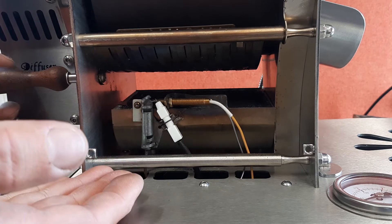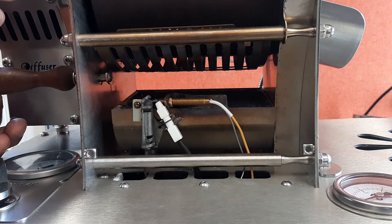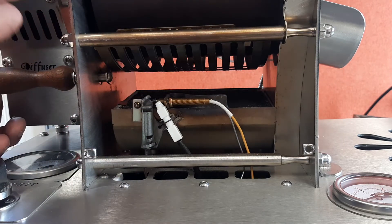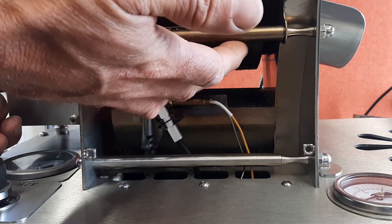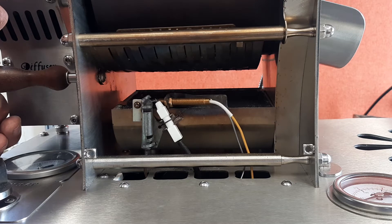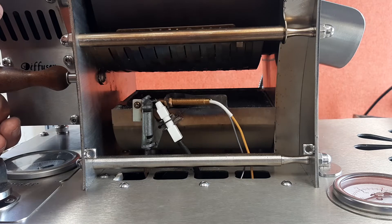The main difference is: when you're roasting with the diffuser in the open position with your beans running in the drum, it is more of a conduction roast — direct heat from the drum onto the beans. With airflow being drawn in the back of the roaster and through the beans, the hot air also roasts the beans. With it closed, it is more of a convection roast. This grid gets hot and that hot air is drawn through, but the rate at which your drum heats up slows down by a lot — it's more just hot air drawn through the roaster that will roast your beans.